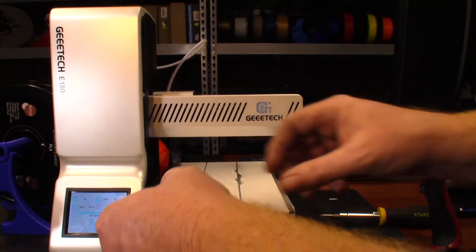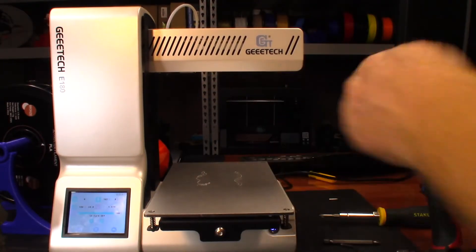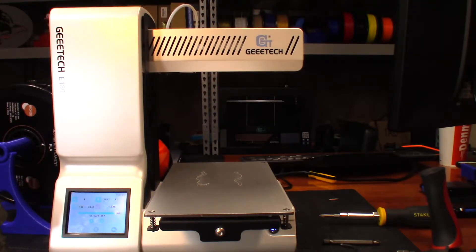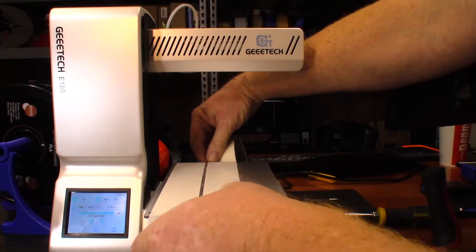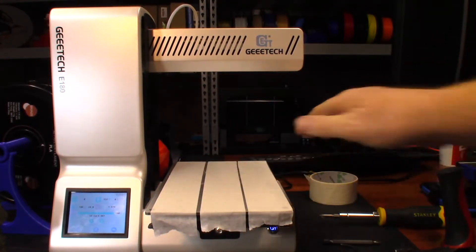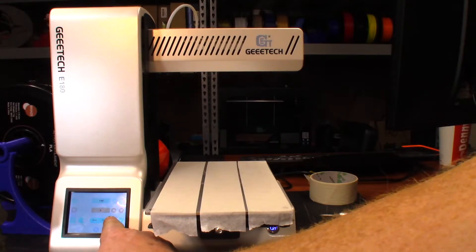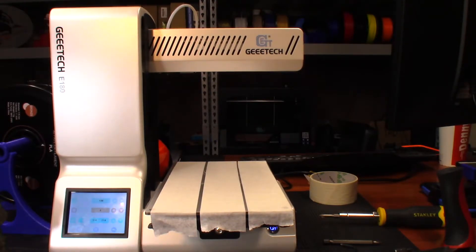There's no use in just tearing up more stuff than what needs to be torn up. As you can see, got a little bit of filament on the build plate itself but tore up the tape pretty bad. So once again, tape, tape, and tape. Good enough. Now we have the tape down and I'm going to keep the nozzle hot - take it back up to 210.